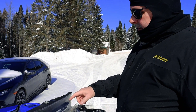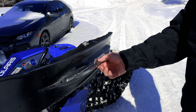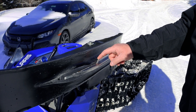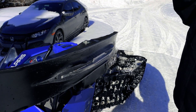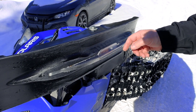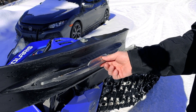Check this out — this is the profile runner. If you notice, the host bar is pretty tall and it's got a nice carbide which is very long-wearing. I've run these in the past without the new design and they hold up very well. What's different about these is that there's a plate right here and there's a machined groove inside the runner that allows you to put this plate in. This ride plate is what makes this carbide runner unique to the industry.